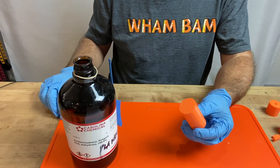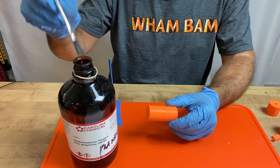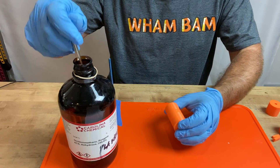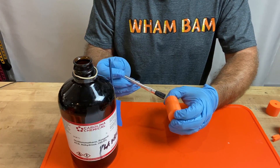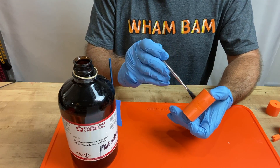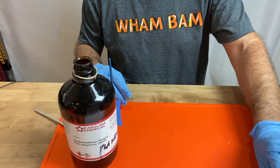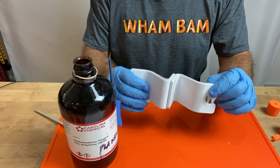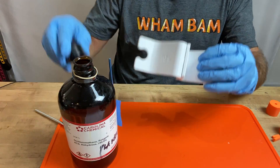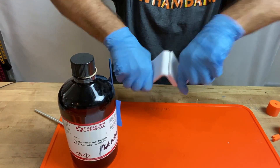Another thing you can do if your surface is already aligned is apply DCM to the outside of a clamped part. Since it has very low viscosity, it wicks into the parts that need to be bonded — sometimes I'll really seal off a part with this, which is amazing. Let's check out this piece I bonded earlier. That was bonded with DCM and I'm going to break the part before I break the bond.